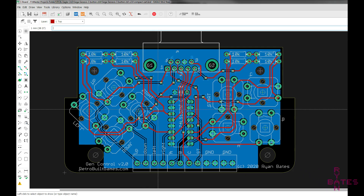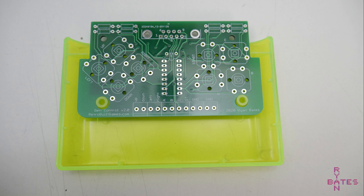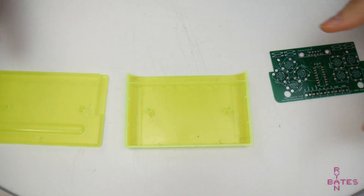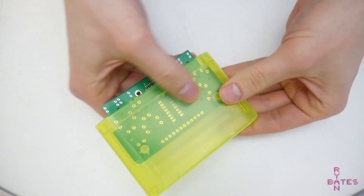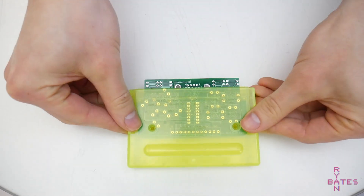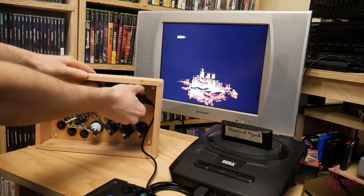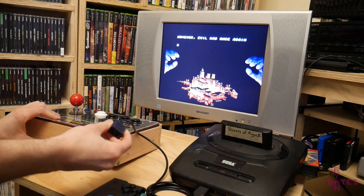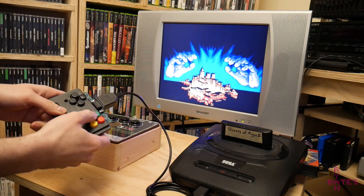The last redesign of this PCB fixed the netless error that plagued me for so long — just making sure all the ground nets are labeled exactly the same. I added mounting holes so this would fit into any Sega OEM cartridge shell and squeezed things in until I reached a pretty good level of satisfaction. You still have to drill the holes for the push buttons, and the alignment is a bit of a chore. I came close to designing the back half of the shell with the button holes cut out, but I just scrapped that and decided to finish the project. Sometimes you just have to come to terms when a project is done, whether the outcome was a success or really just experience you can chalk up for the next project.